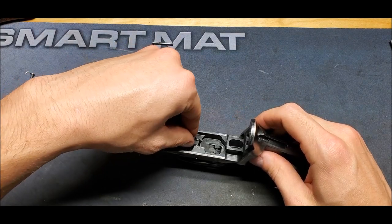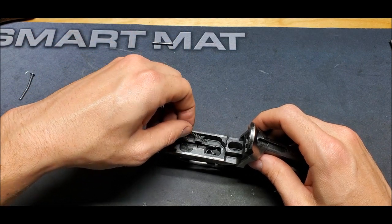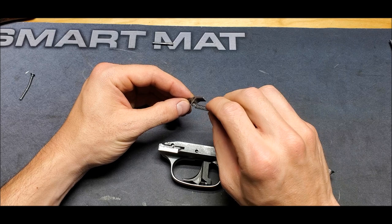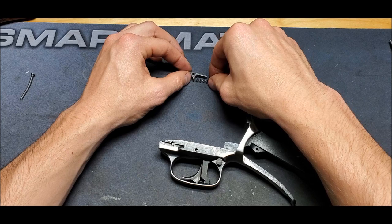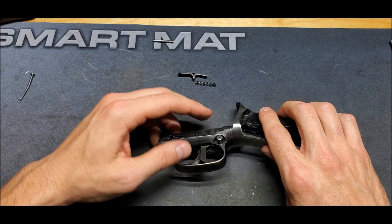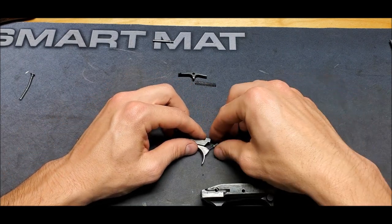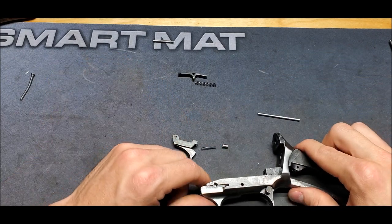Okay, so we will take our sear out first. And it looks like there's our sear spring. So your sear has a divot in that end where the sear spring sits. And your trigger will come out the top. I'd like to keep the parts together while I take them out. Okay, so there is your trigger spring, and your trigger spring plunger,